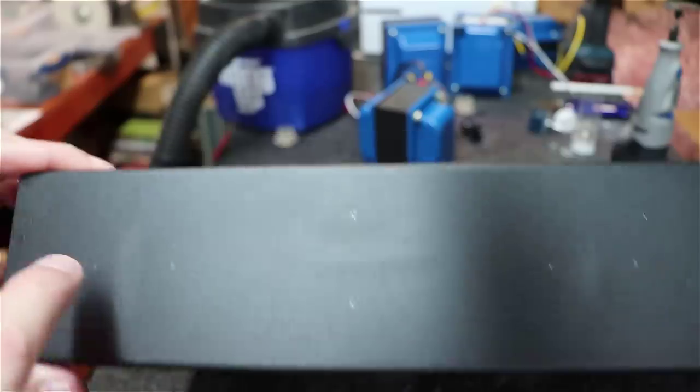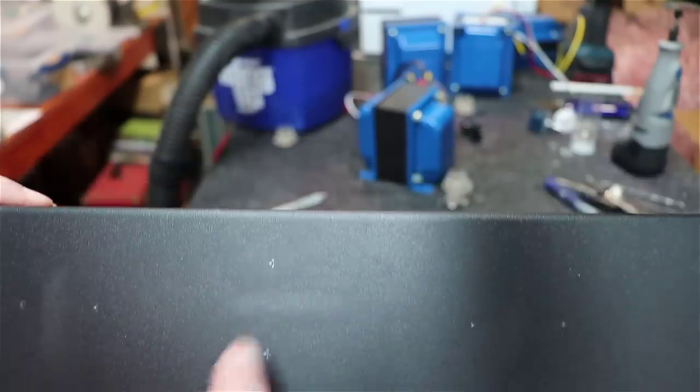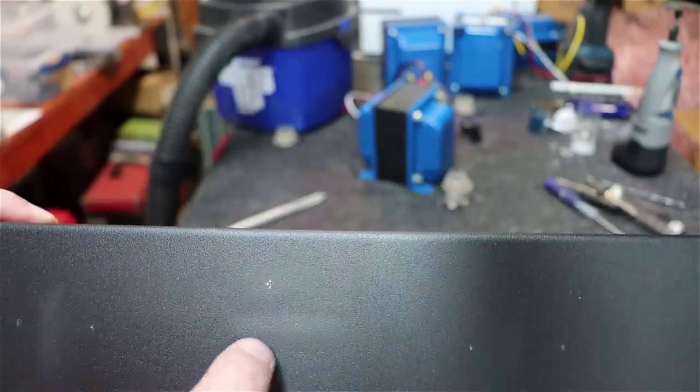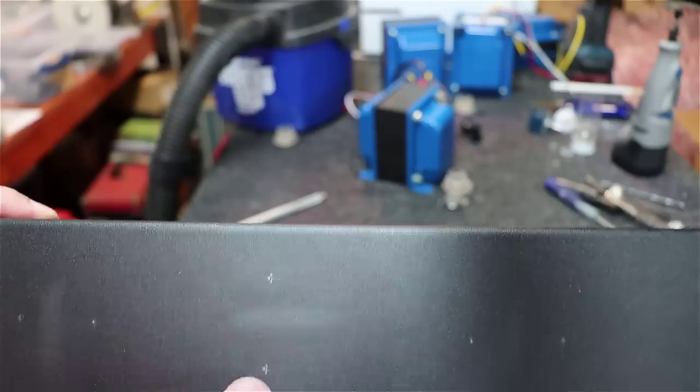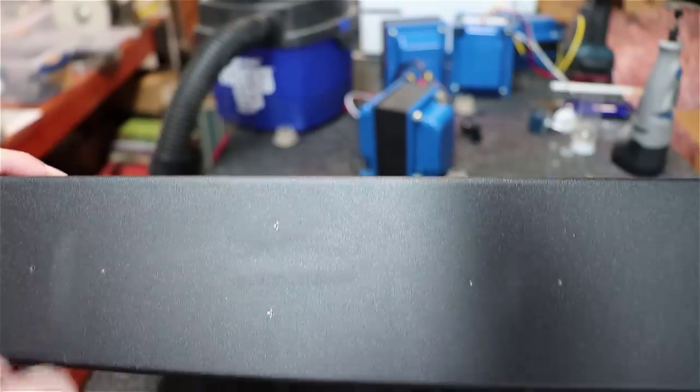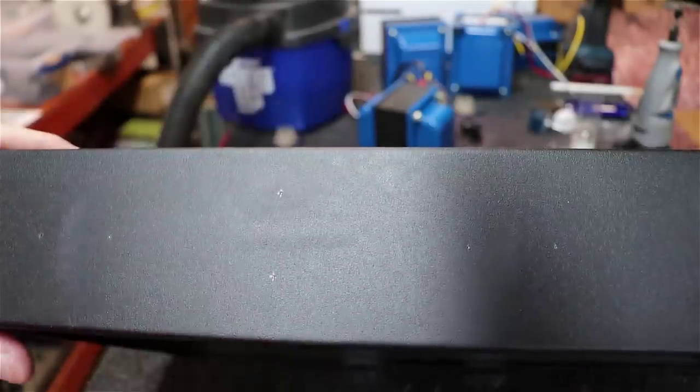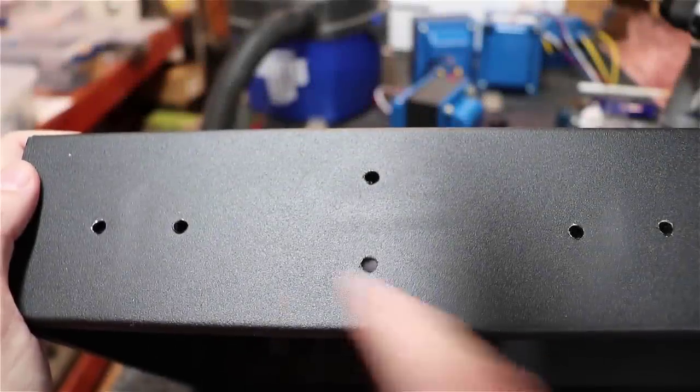These are an inch and a half apart, an inch and a half apart, and then similarly here in the very middle between these two, I marked a spot and I went an inch and a half up and down right here. So perpendicular that way and this way, they're in a good place. Alright, simple enough. Got them drilled out.